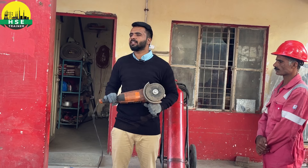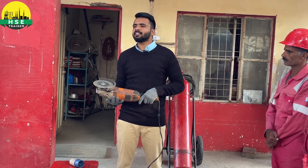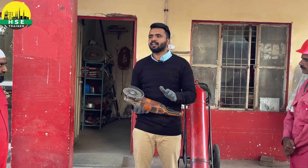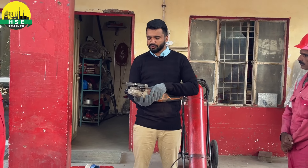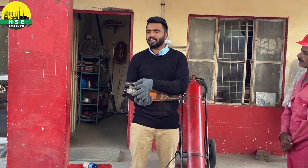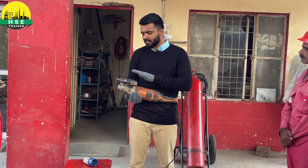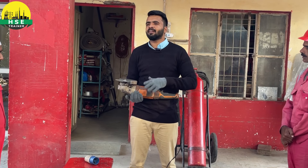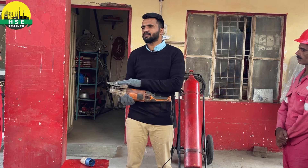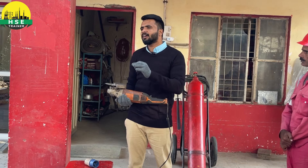After that, the disc. You have to check which disc is fitted — a grinding disc or a cutting disc. If there is a cutting disc, you must only use it for cutting. The cutting disc is uniform in thickness all the way through. The grinding disc will be thicker at the center. Do not grind with a cutting disc — if you grind with it, the thickness decreases and when you then cut with it, it will break. Use the cutting disc only for cutting and the grinding disc only for grinding.